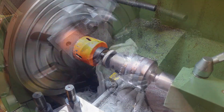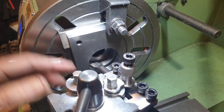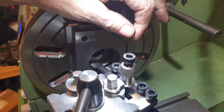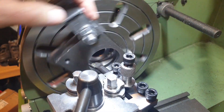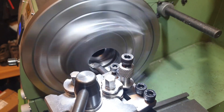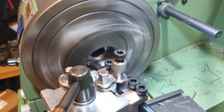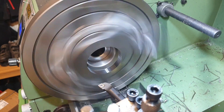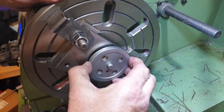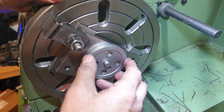And we're through — excellent. There's the core I've just cut out; not surprisingly it is quite warm. I've got the boring bar now in the tool post and I can simply bore this out to 61mm. I need to be careful with all the clamp bolts and other bits and pieces flying around so I don't end up hitting something. That's 60.8 — not quite enough, I'll take off another pass. And actually that does fit, so we'll leave that as is.